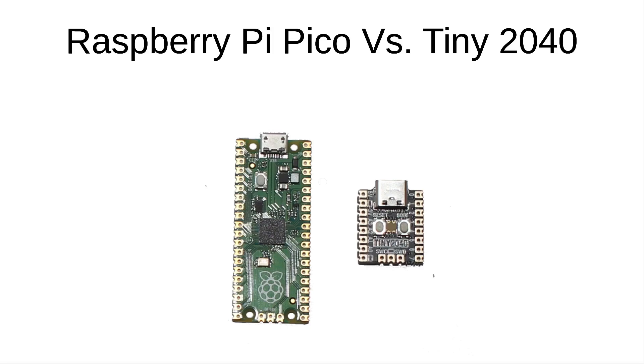If you design the circuit around the Tiny 2040 then it should be easy enough to replicate on the Pico, but note that if you have something designed for the Pico you may need to remap some of the GPIO pins to the pins available on the Tiny 2040. The Tiny is certainly going to be a good controller for wearable projects but may also be a good choice anywhere that space is the main factor.